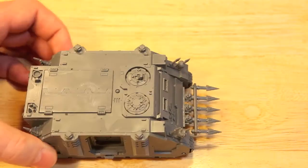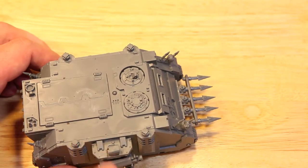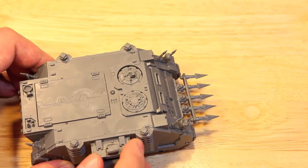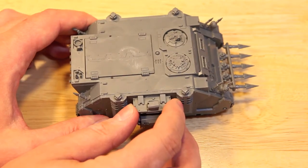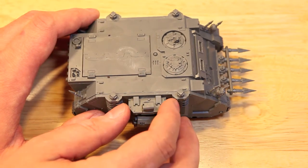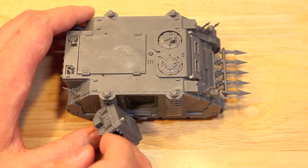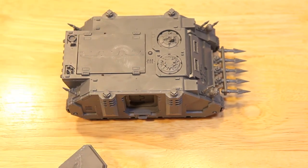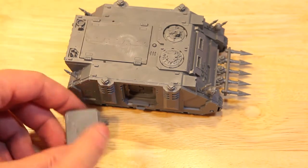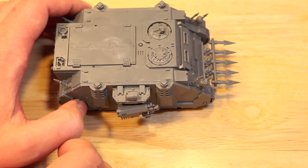Unfortunately, this part demonstrates the other situation, where the two magnets are now in direct contact and the plastic is not. You can see that because when I move this part, it does move easily and it wiggles. When putting these parts together, just make sure that there's a gap between the magnets — a very thin gap, width of a piece of paper, is really what you're looking for. When I paint these, if I paint this side and this side and then put it together, that may actually fix this problem.